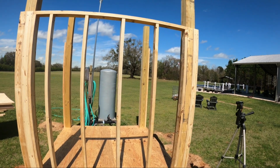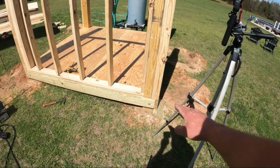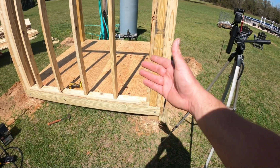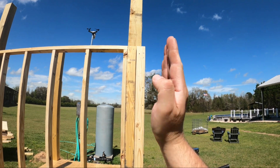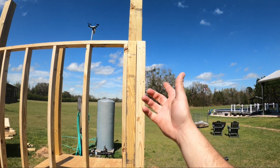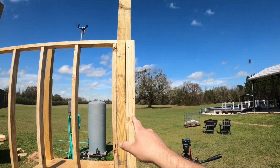Like the 2x4s, for example, are a little over $3 right now. If I had to cut those posts off at the bottom, like a lot of people would do, you would build a traditional wall up and have basically 2 walls meeting right here and here and nail the corners together. That's how most houses and everything else is built. That's fine. This is definitely a stronger method.